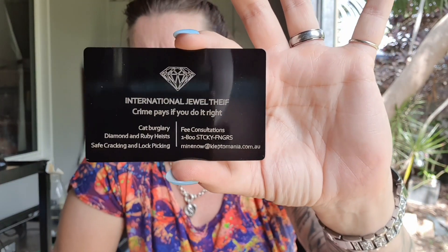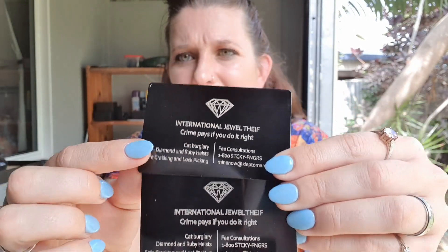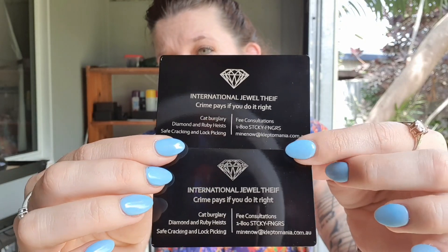Is this one clearer? Yes. What I could do to make this one clearer is probably just slow it down a little bit. They are both on 100% power — this was 10 millimeters a second with two passes and this one was 100 millimeters a second with one pass, so the clarity is affected by how quickly the laser went. But the depth hasn't actually changed — it feels the same on both.